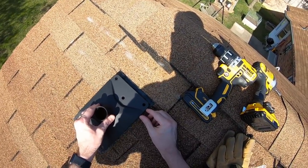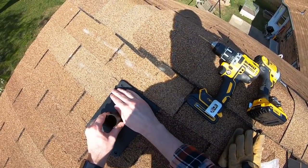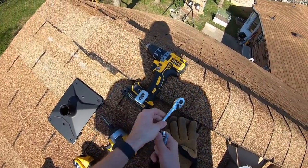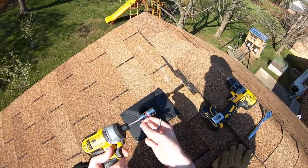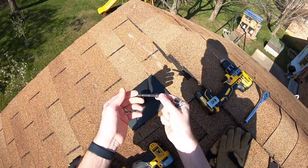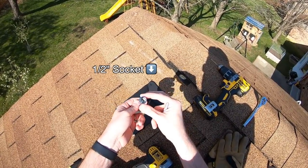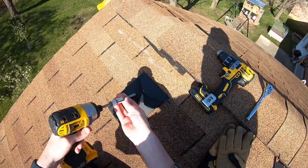This is the tricky part because I don't know exactly where those holes are. I'm going to stick this mount on and hopefully be pretty close, and get two of these screws started at least. I've got my ratchet wrench to hand-tighten them, but to get them started I'm going to use my impact driver — this is another thing not in the instructions. These bits are extremely helpful: going from the impact driver chuck to a square driver and then a socket adapter, so I can get these started. It's really hard to start these by hand.